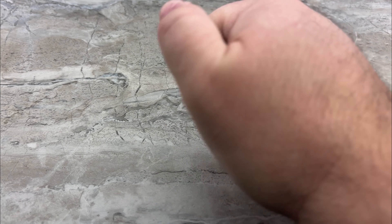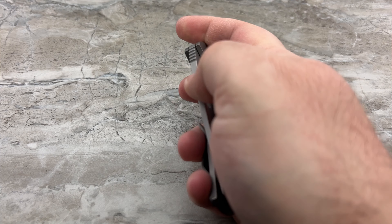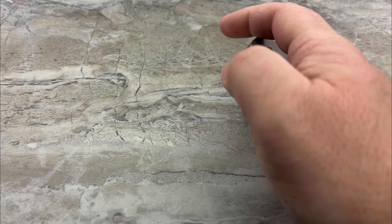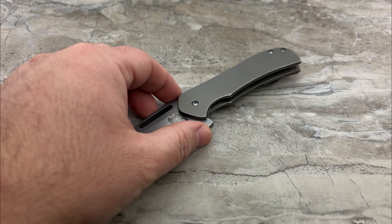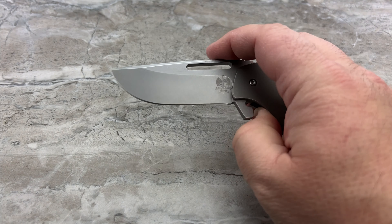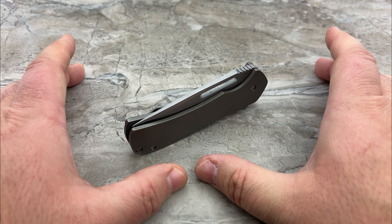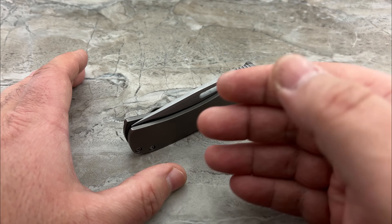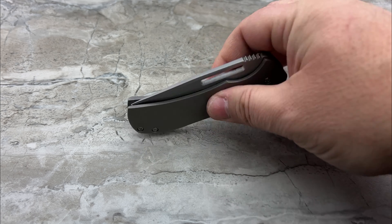This is a wonderful carry knife — slim, lightweight, very easy to carry, great action, super edge. He also does all of his own heat treat, so he controls the accuracy of the heat treat in these blades and controls the performance level of the steel. That's very, very important to realize. There's nothing wrong with farming it out to someplace like Bos or something like that, but when the knife maker himself can do their own heat treat, they've designed a knife for a specific task or variety of tasks, they've chosen their steel and their bevel angles according to what that usage might be — so when they heat treat it, they're going to heat treat it to be most beneficial for however the knife was designed.